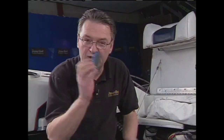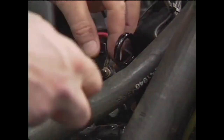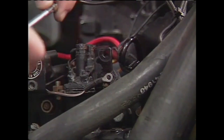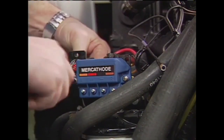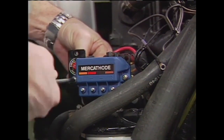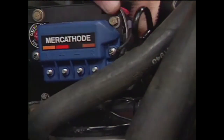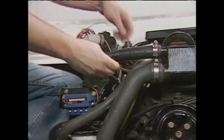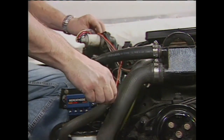With the hard part done — getting the wiring fished up through the hydraulic block and through the transom into the boat — the easy stuff is next. First, install the MerCathode solid state unit and then move on to the wiring. Remove the cover from the engine circuit breaker box and disconnect the trim indicator signal wire. Mount the control unit to the lower holes on the circuit breaker box with the supplied bolts and nuts and reattach the cover. The wires from the electrode should be routed over the top of the engine following the route of the wiring harness to the control unit.